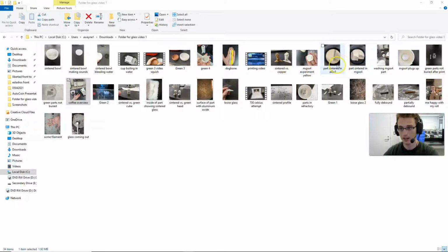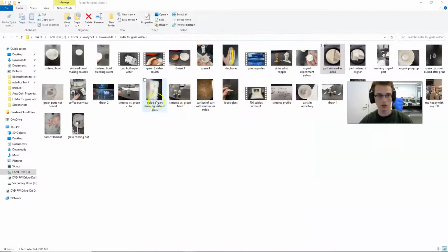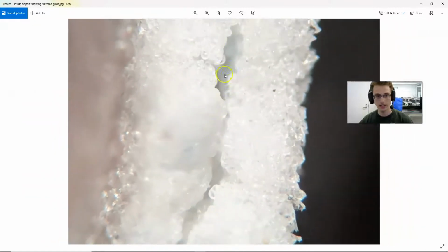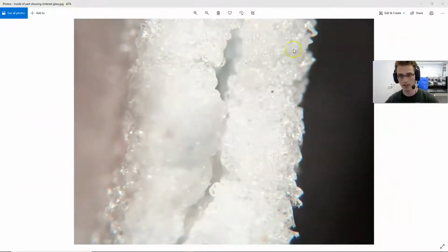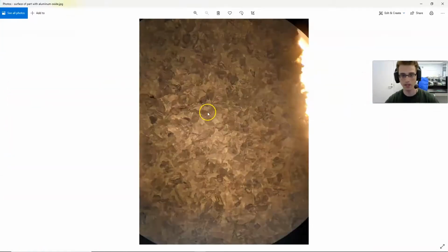One problem was that the refractory material, this aluminum oxide, even though the part I showed you before, the inside is kind of these round pieces of glass, like the original Pyrex beads. Even though there's round pieces of glass, if you actually look at the surface of it, it looks like shards. It's sharp. You can feel it. It's very rough, and it's not that smooth glass. This is actually the aluminum oxide binding and fusing to the glass.